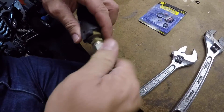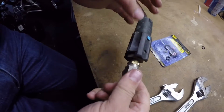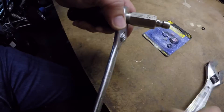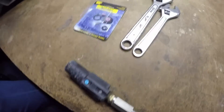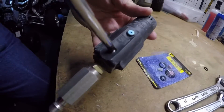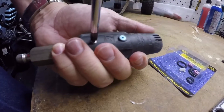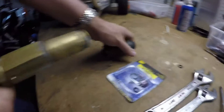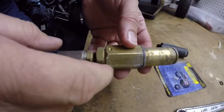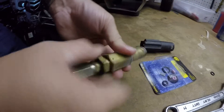Now we can put the filter back together. Whenever you tighten any of this up, turning it this direction is going to tighten it and stop the spinning, so you always want to put a wrench on to tighten up your fittings. Now if you want to rebuild this Rotomax, you take out this screw right here — sometimes they can get kind of difficult. Once removed, you can pull the housing off, and this is the Rotomax without the housing. It can be separated into two different parts.